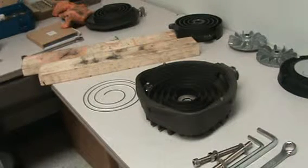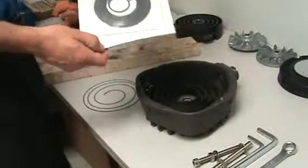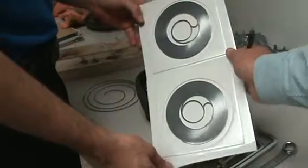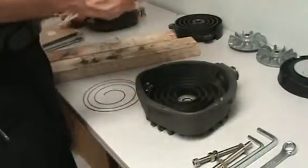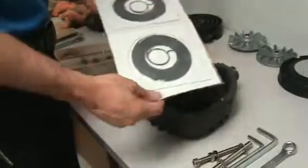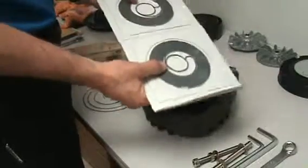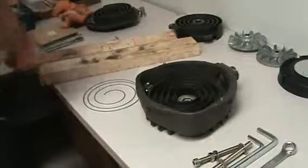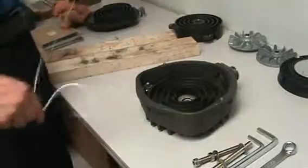Now, my customers say that tip seal replacement is a concern. When you get the kits, it's going to look like that. Let's bring it down to the shot just a little bit more. All right, that's what it looks like. Which is the outside, which is the inside, or is it just how it's oriented? On fixed scroll 1 and 2, it doesn't matter which one of these you use. But on the orbiting scroll, orientation matters. So, obviously, this would be longer.